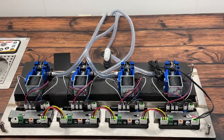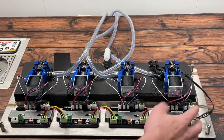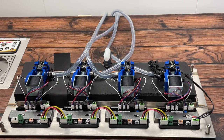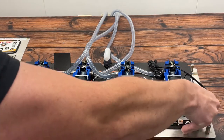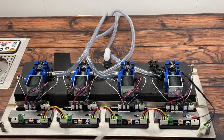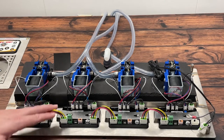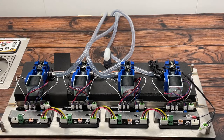The method starts by unplugging the dispenser first. If you're looking up at a dispenser from the normal installation side, the power usually comes in on the left. I have this dispenser flipped upside down so that we can have a good view of what is going on. The first step is to unplug the power supply from the first circuit board, which will unplug the power to all of the circuit boards connected through the jumper system. Next, disconnect every wire, including the jumpers, from every circuit board on the dispenser — however many you have, unplug them all.